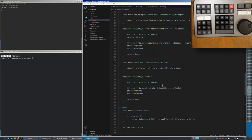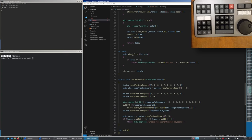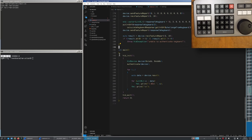I have the nice shiny C++ version with the HID stuff pulled out into a class, the authentication stuff pulled out into a nice small function. The main loop just looks like this: open the device, authenticate the device, then repeatedly read packets from the device and print them.